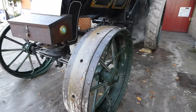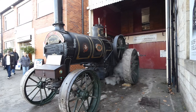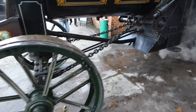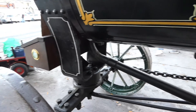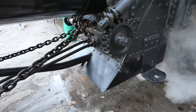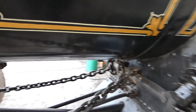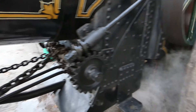And you've got your tombstone above that, supporting the front axle. You've got lamp brackets with the chimney on top. Looking down, you've got smoke box, boiler barrel, fire box, and the rear end. Steering chains, and the pipe in the middle — there's a blast pipe, which takes exhaust steam from the rear of the engine on this particular engine through the ash pan, and then up to the bottom of the smoke box, terminating at the blast pipe.